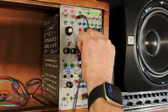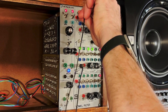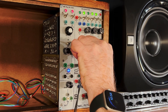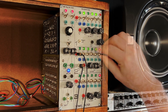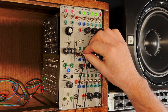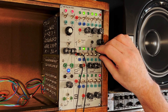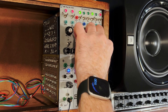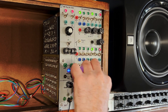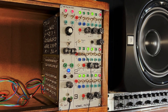Now I'm listening to the second stage, still keeping the signal coming into the first stage, switching the frequencies and adjusting the gains. I can also adjust the frequency continuously at that stage with the MOSFET. And now I'm listening to the output of all three stages cascaded — the normal output of the speech synthesizer kit — just switching the filters and playing with the signals in between. Sweeping the MOSFET filter, you can hear that cutoff with the distortion it does.